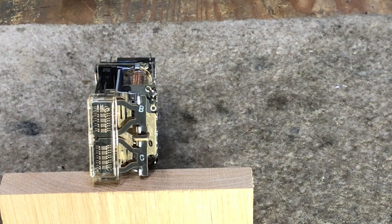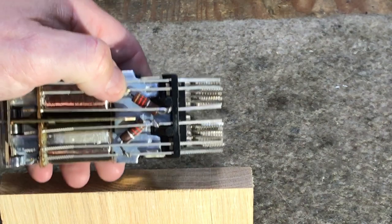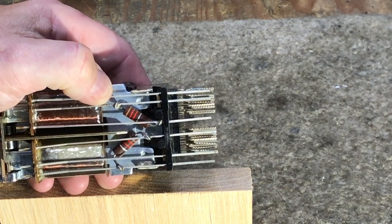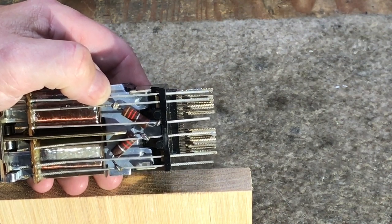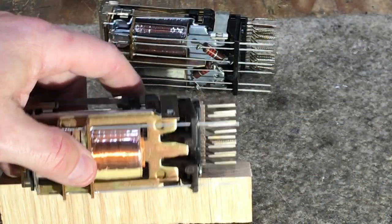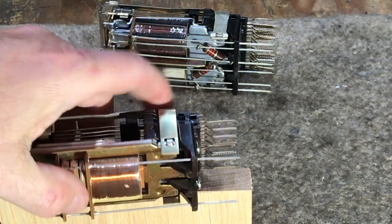Using a magnetic latching circuit, they just sent out a pulse to operate the relay, and then sent out a pulse of the opposite polarity to knock it down. These relays are relatively useless for most applications that collectors and hobbyists would have. You'll notice there are resistors across the coils with a common coil — you need positive 24 volts and negative 48 volts to make this relay work, and it only needs to be a pulse. The larger series relays, instead of being a dual relay, would just have a single resistor across the coil.